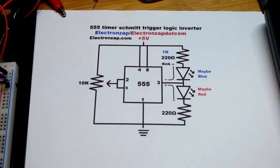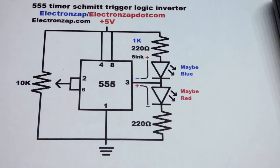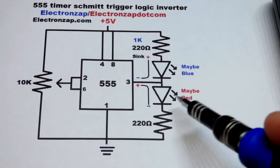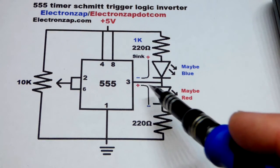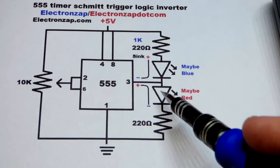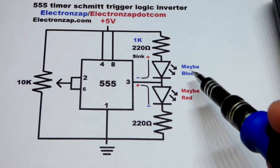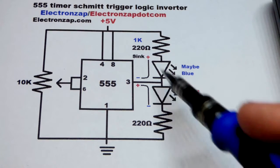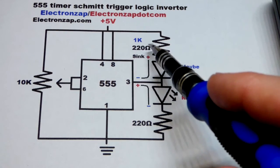Now, the output — if we use LEDs, it makes it a lot easier to see what the output is doing, high or low. We can color code it however we want. I'm going to use red, at least at the beginning, for it to light up when the output is high. The LED will lead to the negative rail, ground, our 0 volt reference point. I'm going to actually use a green LED, but the green LED has pretty close to the same electrical properties as the blue one. They're naturally brighter than the red ones, so instead of 220 ohms to protect it, we're going to use a 1 kilo ohm, a higher value.